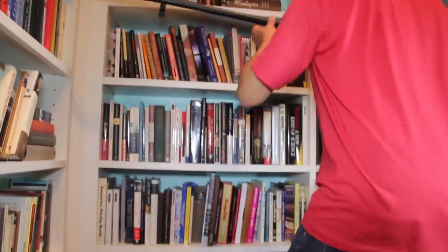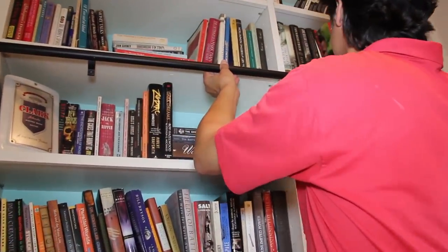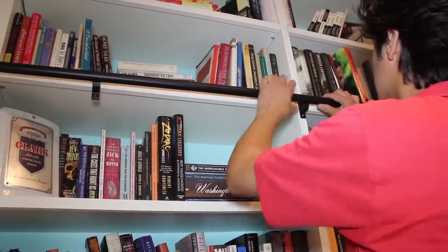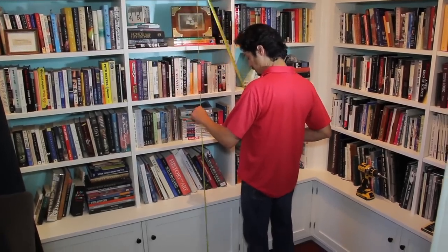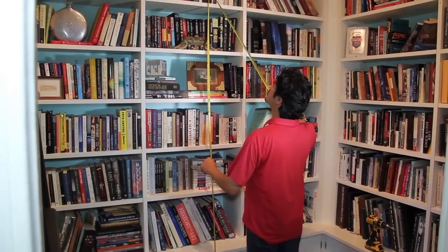You want to line up the track with a shelf so it won't block your books. Pick one high enough that you'll be able to reach the top shelf but low enough that there's at least 7 inches to the ceiling. That leaves room for the top of the ladder when it's pushed upright for storage. To find the length for your ladder, measure from the floor to the shelf and then add 5 inches to create a comfortable climbing angle.